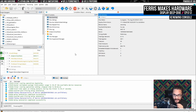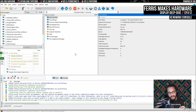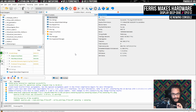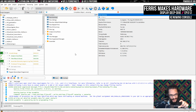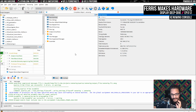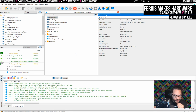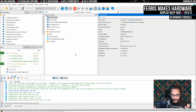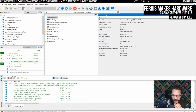Once that works, I'm considering also doing some basic texturing where I have a texture cache. So I'm thinking that the texture cache will be in the GPU, inaccessible to the CPU. And I'll probably have a GPU command that says DMA into the texture cache from this range. And that's how you would actually get it to load that, because that would be way faster anyway. And then another GPU command would be render, and some internal state to the GPU, which you probably also have to put in the command list to change that state, would be to actually do texture mapping from that cache. If that cache is relatively small, then we can just do one cycle access on that and no filtering.